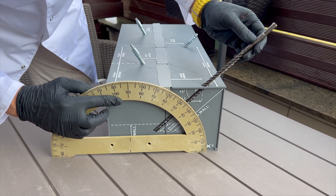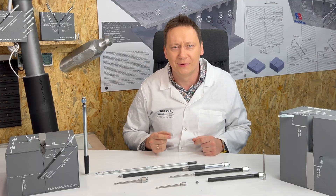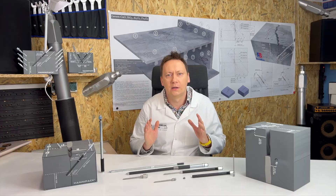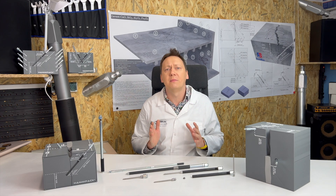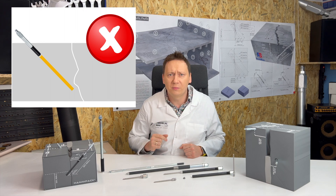Common drilling angles are 45, 60, and 30 degrees. The reason is simply geometry. Some say to stay a centimeter from the crack and drill at 45 degrees, but this works only for a 20 cm thickness wall. For other sizes, it won't be effective.